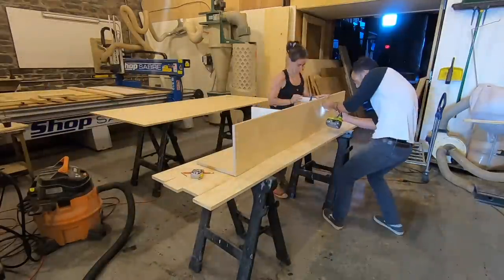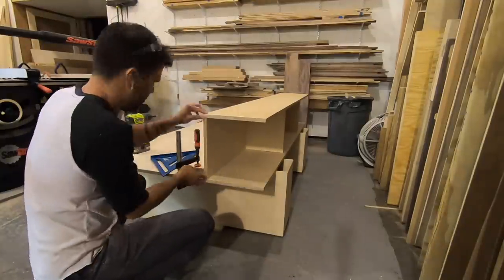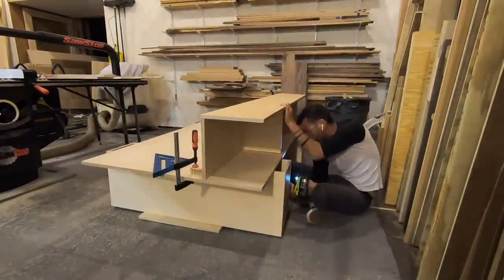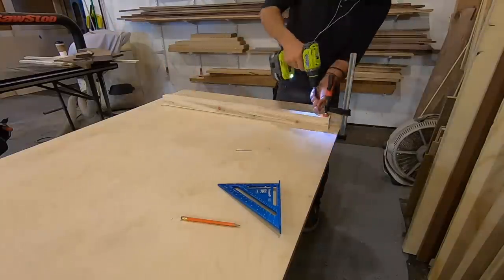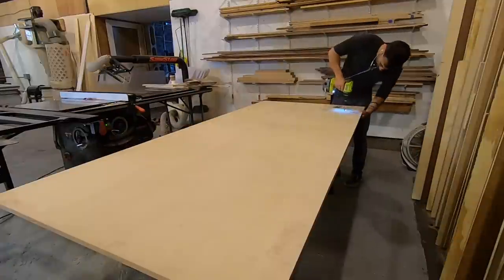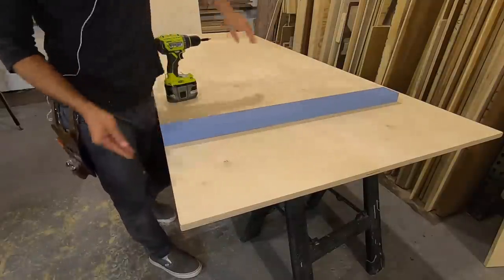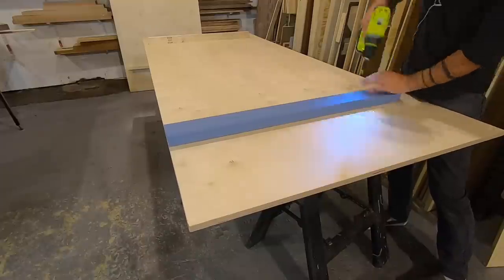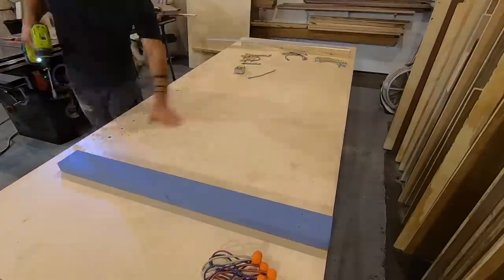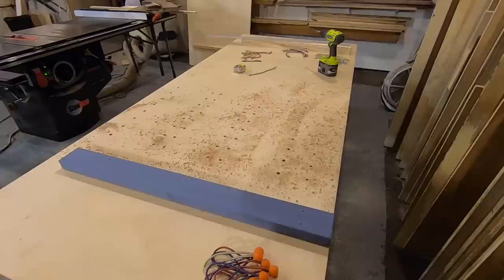This assembly is going to create shelves up above the bed and the roof for the bed canopy. I screwed two by four ledges to the side panels, making sure to add screws from both sides. For the visible two by four supports I used the ones that I painted blue, but the other ones I just left raw. For the panel that goes at the foot of the bed, I drilled a whole bunch of half-inch diameter holes. This is going to allow me to add bungee cords which will hold the stuffed animals up against this vertical panel.